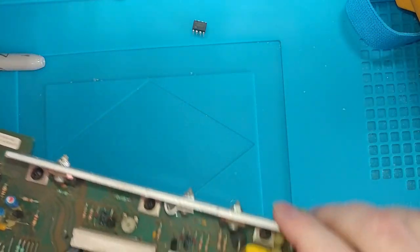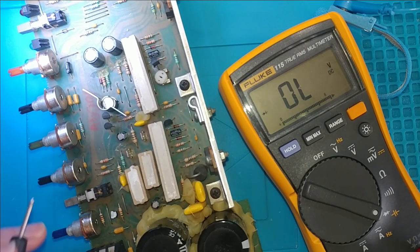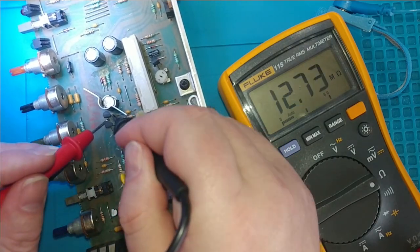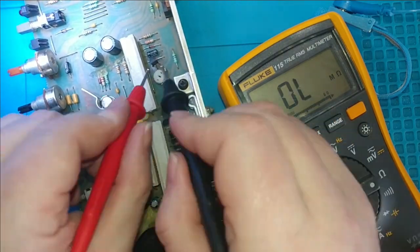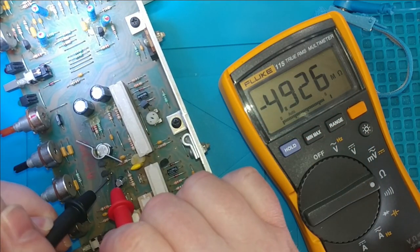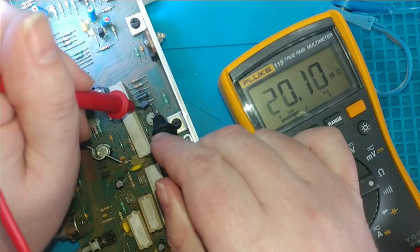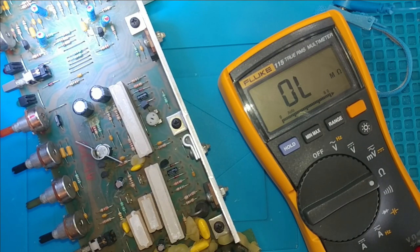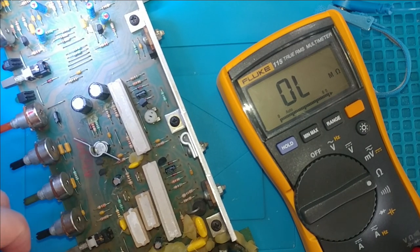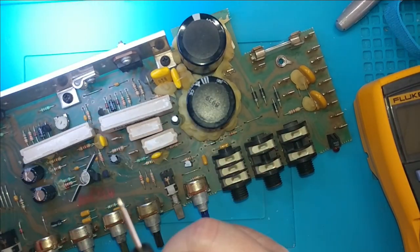And the last thing I want to check are some transistors. So just fast forwarding through the section a bit, I am in circuit testing of our 2N5087 PNP, 2N5088 NPN, and 2N3403 NPN transistors. However, because they are in circuit, it's not really the best way to test these components. And I eventually decided to remove a few along with other components to test outside of circuit. And here in a second, you'll see me pick back up on that.